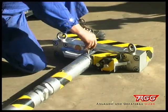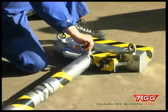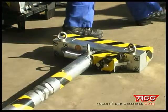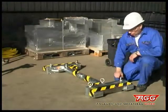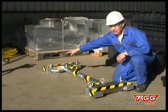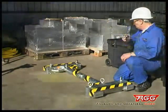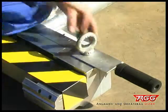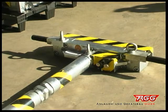Once again, the thread bolt of the eyelet secures the plug connection. All the other wheel load scales included in the delivery are assembled the same way. Let us now show you how to place the mounted parts into the track system. Use some lifting equipment available or mount the 4 carrying handles, being part of the delivery, to position the scales into the track system.